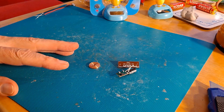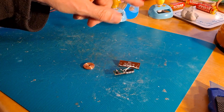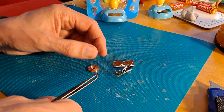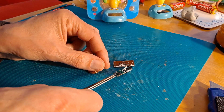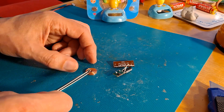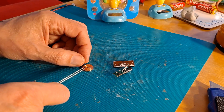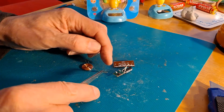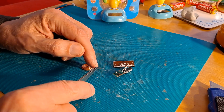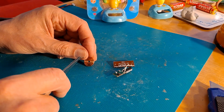What might go faulty? Well, these hair-thin wires — if you've dropped the rocker on the floor and it's partially disassembled and the coil has jumped out of its little hole, then it might have jerked the wire and broken it. If you're lucky, you've still got enough to reach and re-solder. If it's actually broken off the coil somewhere deep inside, then you're probably out of luck because the chances of finding the end again are virtually nil. So if it's broken and you can re-solder it, all good. If it's broken in the middle somewhere, you might be able to add another little bit of wire to piece it out. But if it's broken where you can't see the end anymore, you're probably out of luck.